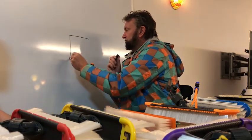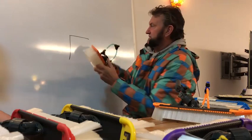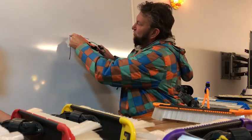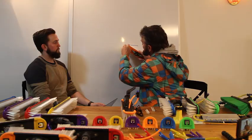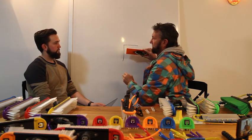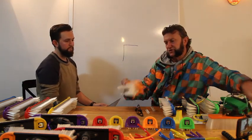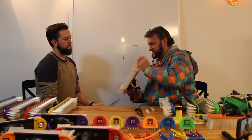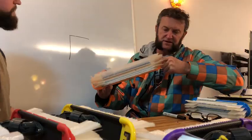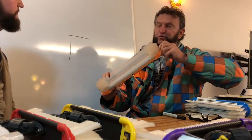So if this is your corner, and you go across like this, and you go into the corner, you can never get the jet into the corner. If you want to get the jet into the corner, you go like this, and then you wet above the frame, or wet above your agitation zone. So that's why we've sustained and maintained the principle of having the jets in the middle. Now we've put Hydroblade in there, which gives us a perfect flow and a controlled flow.